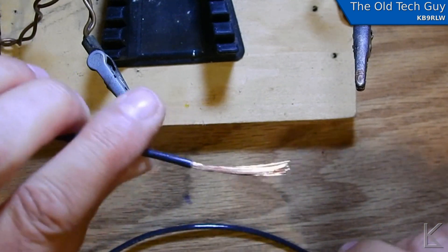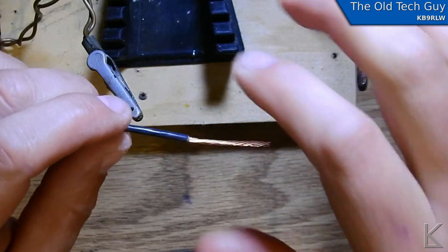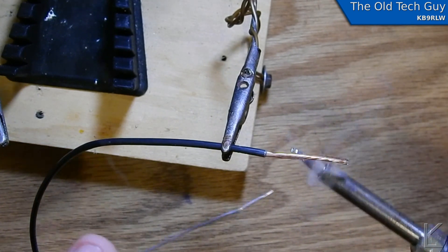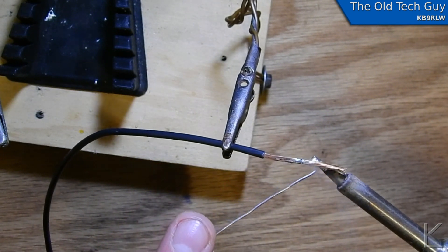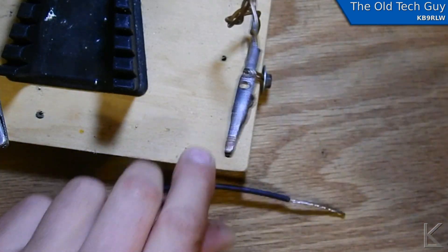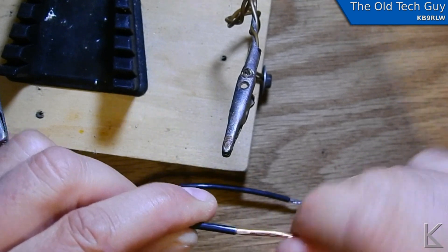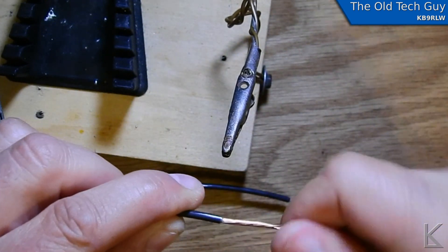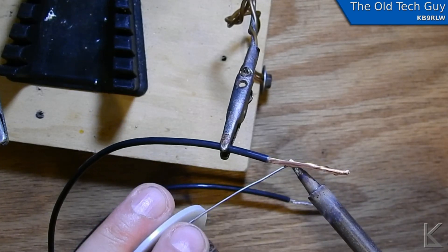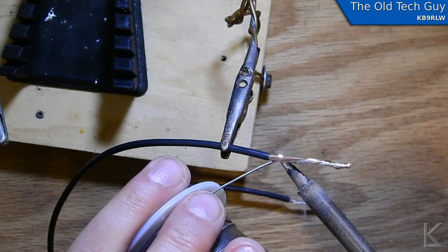What if you're using stranded wire? Well, it's not as easy to work with, because all these little strands are going to fly out in all kinds of directions. So the first thing I'll do is I'll just twist them up a bit. Then we'll take the soldering iron and we'll just tin it lightly. That will keep the strands together and allow us to do the loops for the lineman's splice. You can look at the wire where it comes out of the jacket and see which way it's twisting, so that you twist in the right direction. If you twist in the wrong direction, you'll be untwisting the wire at the point where it goes into the jacket and you'll make a weak point. Just tin that — just a little bit of solder flowing through the strands to keep them together, to make it act like one wire instead of a bunch of little ones.